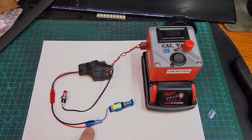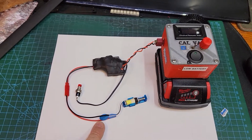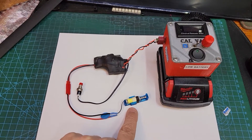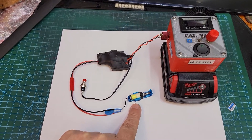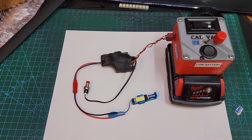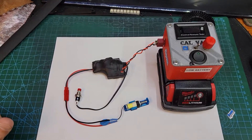This little deal is an MOV — Metal Oxide Varistor. Its job is to absorb the voltage spike that happens whenever this thing is powered off. That's just a property of a magnetic coil. If you apply power to it and remove the power, it generates a voltage spike. So this absorbs it and protects the components behind it.